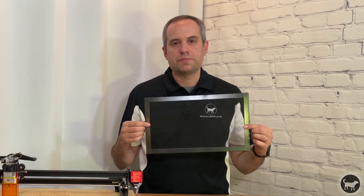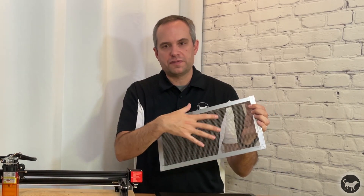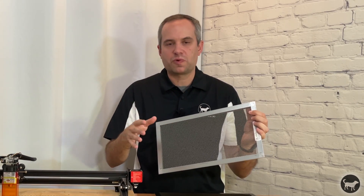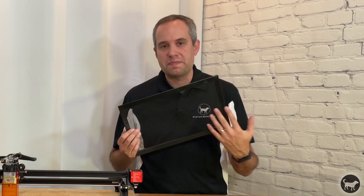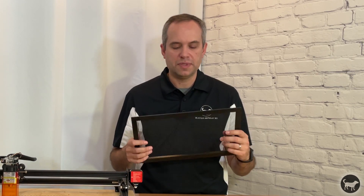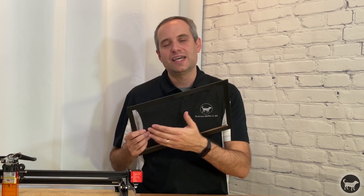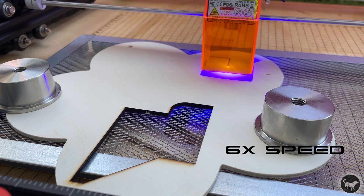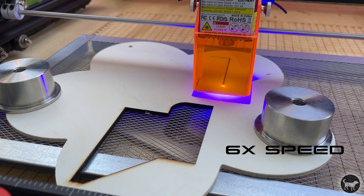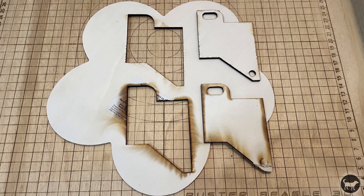What I ended up doing was taking that same grate and painting it black, because on the original version the laser would reflect off the shinier pieces and burn in areas where I didn't want it to burn. I used the most matte paint I could find at Home Depot. Maybe in the future I'll try some of that Black 3.0 paint that's supposed to absorb more reflections. As you can see, it does a really nice job cutting through the part. The bottom piece was cut with the part directly on the spoil board, and the top one was cut with the part elevated. Notice the less charring on the top versus the bottom piece.